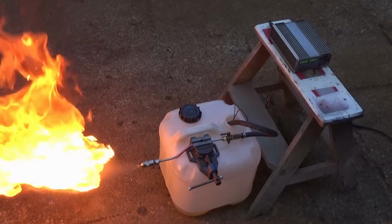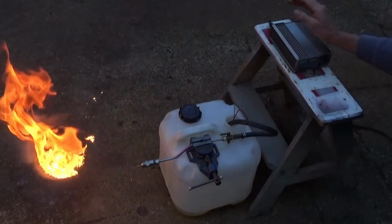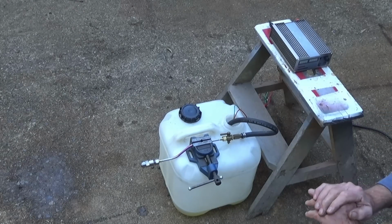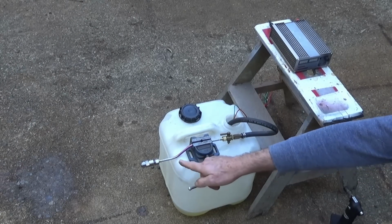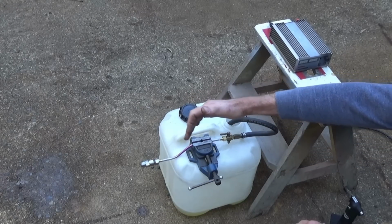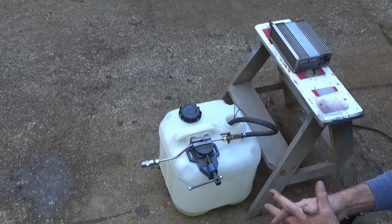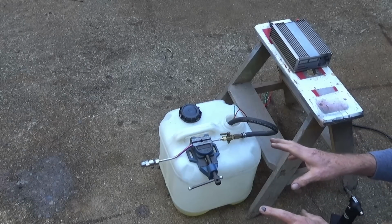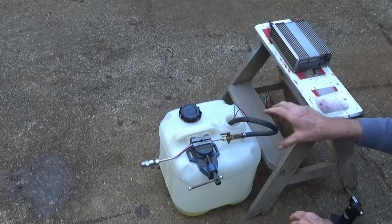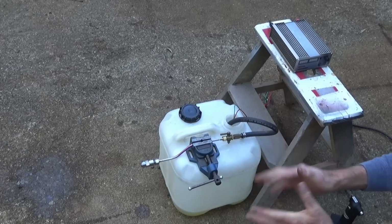Wow, that's intense. And it's surprising the amount of heat that's coming off that, just radiant heat. But you'll notice it's not burning right back against the nozzle. So the flame front is burning out probably about 6 inches, 150 millimeters from the tip of the nozzle. Now, all of that may change when we get this confined inside the burner tube and we get a supply of auxiliary air going through that tube. But for the moment, that looks encouraging.